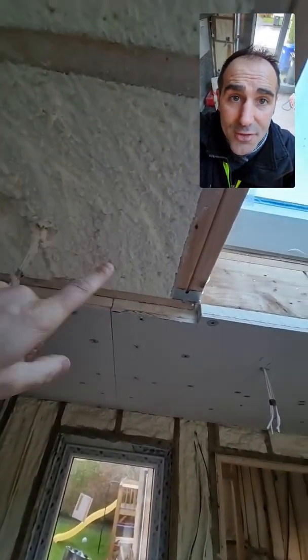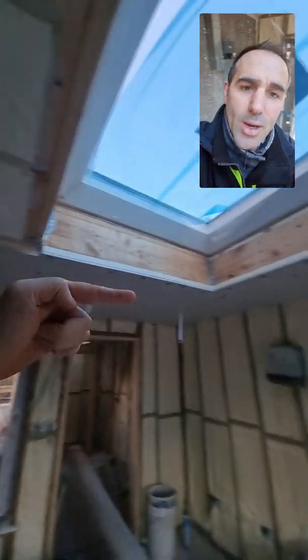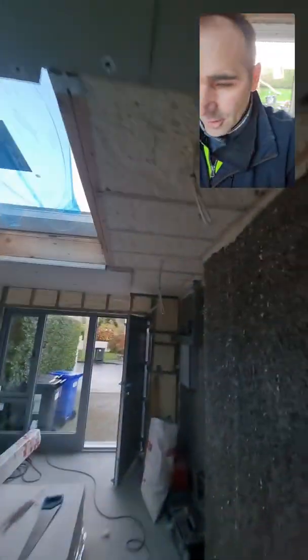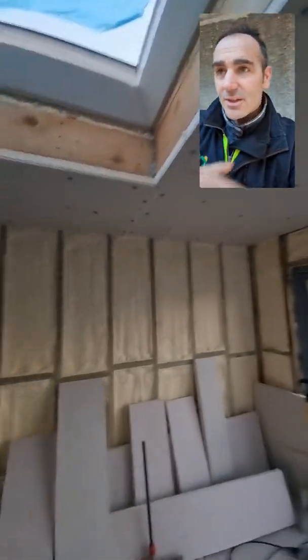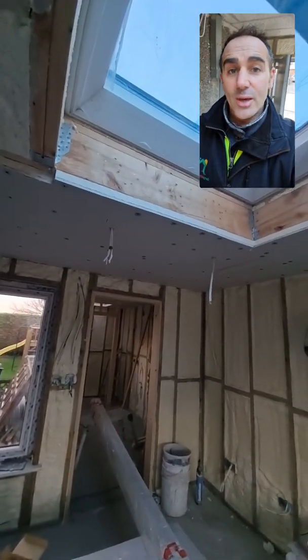The other natural dynamic is that your ventilation system is behind that — your ventilation cavity — moving air away on the outside of the roof to your vents. With a warm deck you get the insulation on the top, you get the joisting system, and a lot of times there's air movement in the joisting system.